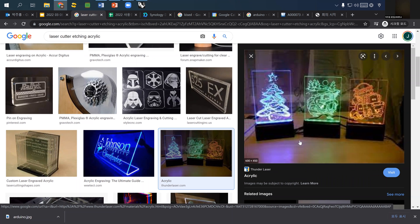The way this works is that you need a black and white grayscale image. In a grayscale image, each pixel has a value from 0 to 255. White is 255 and 0 is black. The whiter areas will cut more, but the zero areas will cut less. It's pretty easy and really up to you. Does that make sense? You are highly welcome to use any etching too.